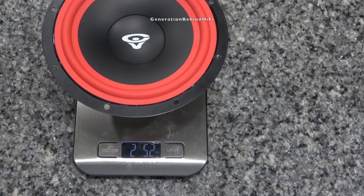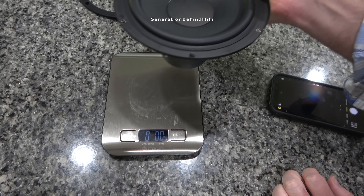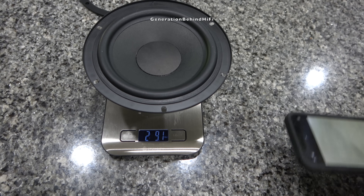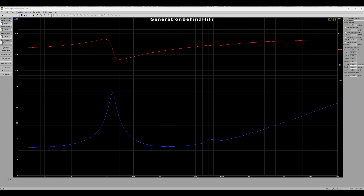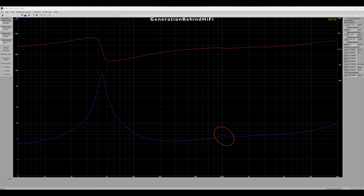The woofer from my LA165 weighed 2 pounds 5.2 ounces on my scale. For comparison, the mid-range woofer from my Haco Aurora 700 weighed 2 pounds 9.1 ounces, and the woofer from my Polk Monitor XT20 weighed 3 pounds 2.8 ounces. The woofer from the LA165 measured okay on my bench. The resonant frequency came in at 58Hz, and there is a small resonance around 750Hz, which is pretty typical for a speaker of this size — even the woofer from my Bowers & Wilkins 705 S2s had a similar resonance in that frequency range, likely caused by cone breakup or surround resonance.